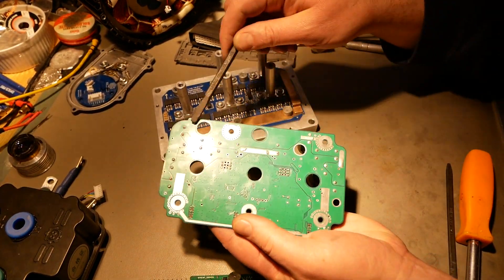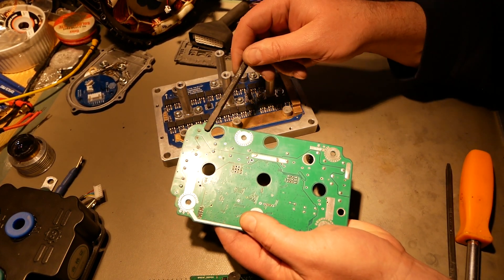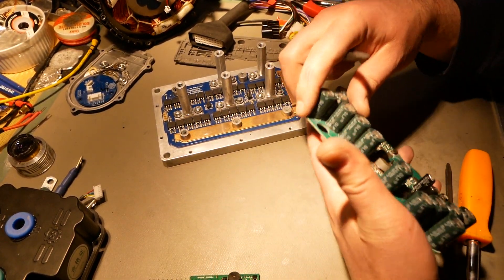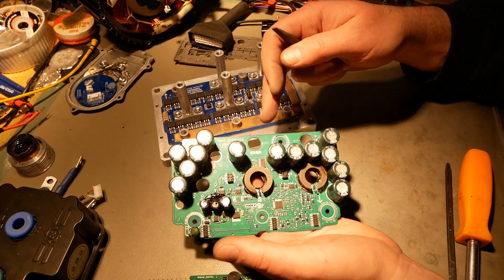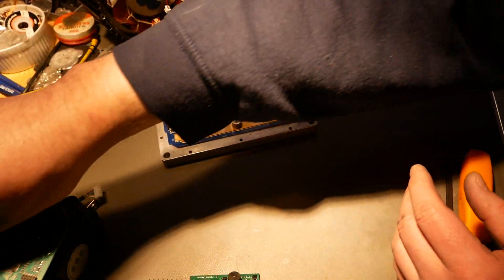Battery plus, however, is a current path — and that really should just be for ripple filtering, but it's a supplemental current path done here and I don't like seeing that. I didn't like it on the Kaomoto controllers and I don't like seeing it here either. You shouldn't do it that way.